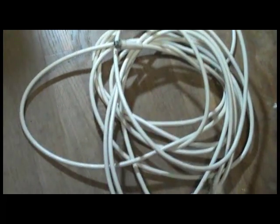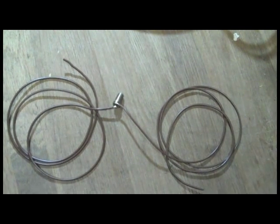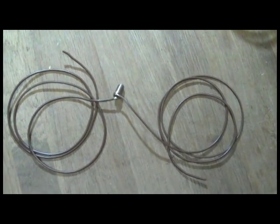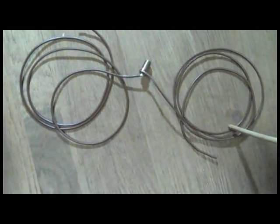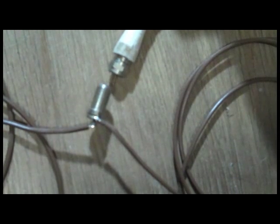This is a standard 25 feet in length. And this is the antenna itself, which I've already made a rough untuned version with just crude measurements. What I have here is an F female connector that came off of the back of an old parts set. I have my two leads — one is soldered to the center and the other is soldered to the outside. This is just a regular connector out of a 90s TV, and this is the same connector that's sticking out of the back of the modulator. It screws right into here.